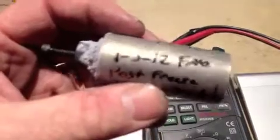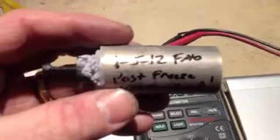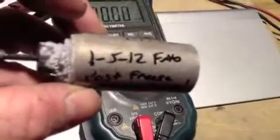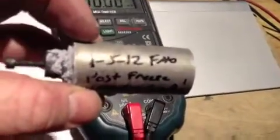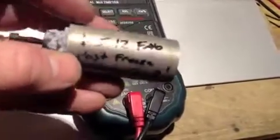No water has been added to that — pretty interesting stuff. I'll also try to include a picture of the performance of the cell as it was frozen, showing that the milliamp hour came back despite the external portion of the cell being frozen. In the final analysis, that is to be expected considering there are some forms of salts here, and whatever residual water is in the lattice itself was probably buffered by the presence of those ions. It took to about 109 degrees Fahrenheit below zero before the cell stopped producing current, but it did bounce back whilst still frozen, which I find fascinating and encouraging.